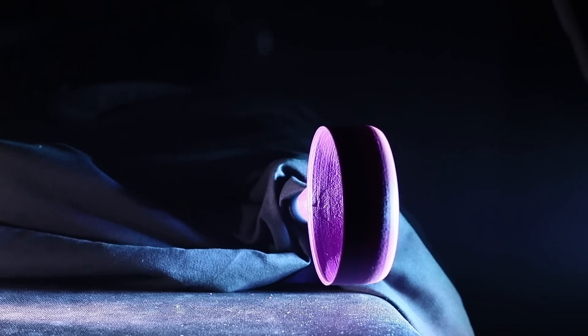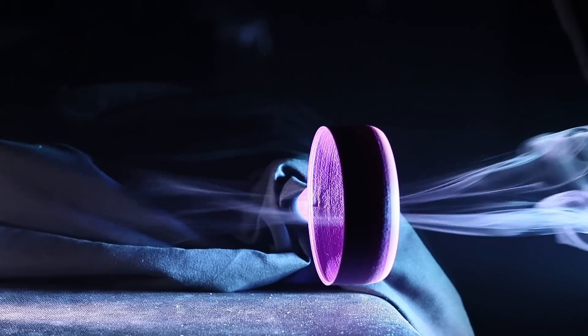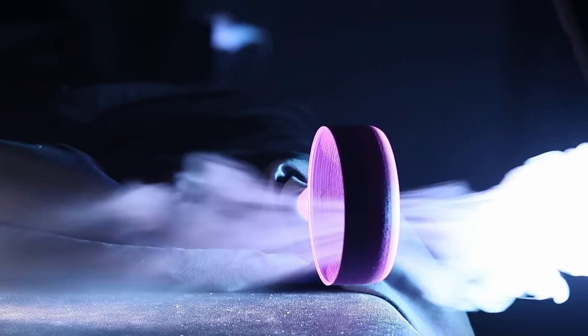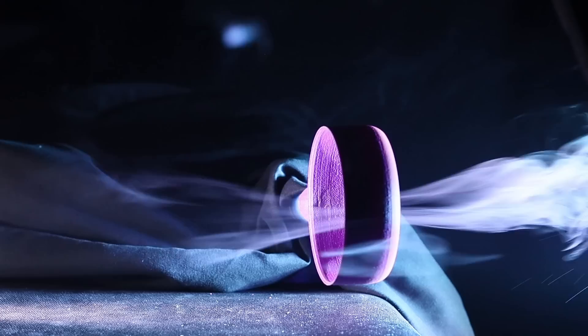For the larger hoop, it's still working to pull air in from behind pretty nicely, but the air in the center is not moving as quickly as with the smaller hoop, and the cone is growing more rapidly as it leaves the front of the duct. I think this hoop is just a little bit too large for the fan I'm using.